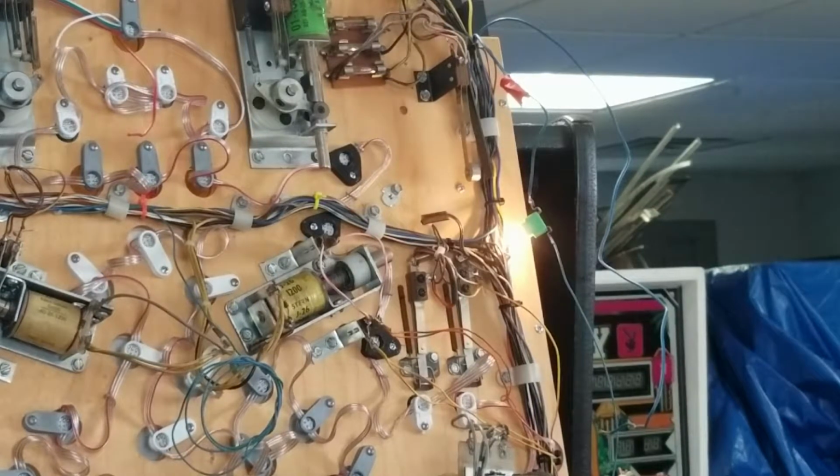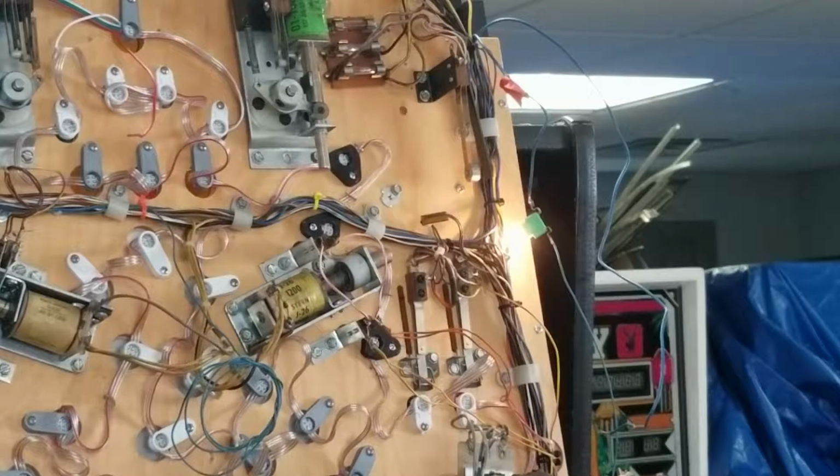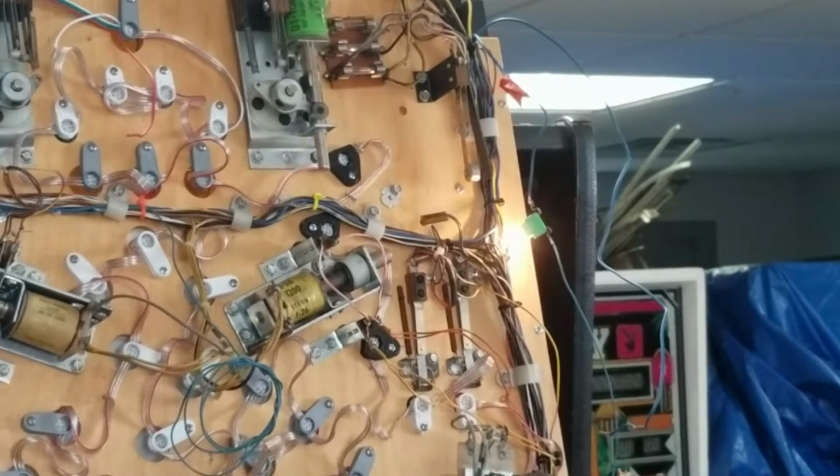No, because that should have already reset. It should have gone through the thing now. So this should be off now. My belief is it should be off. They wouldn't run the solenoid driver activated all the time. Again, this could be a code issue. I may not be firing the SCR correctly. What this is saying is that the SCR is turned on right now. So, not what I was hoping for, but we'll troubleshoot it out and see what's happening.